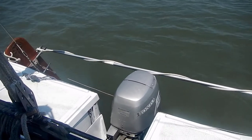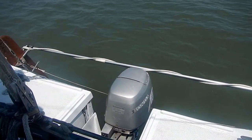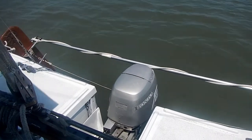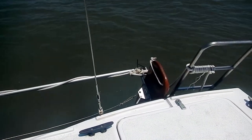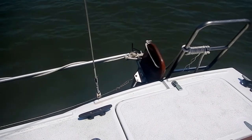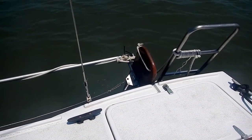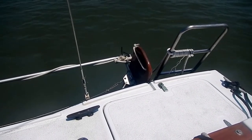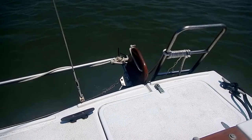If the single steering cable fails — maybe it's doing the work of two now — I guess what I'll do is unbolt it from the rudder cassette and bind up a boat hook or something to one of these two rudders and use it as a tiller. Don't know what else I can do.